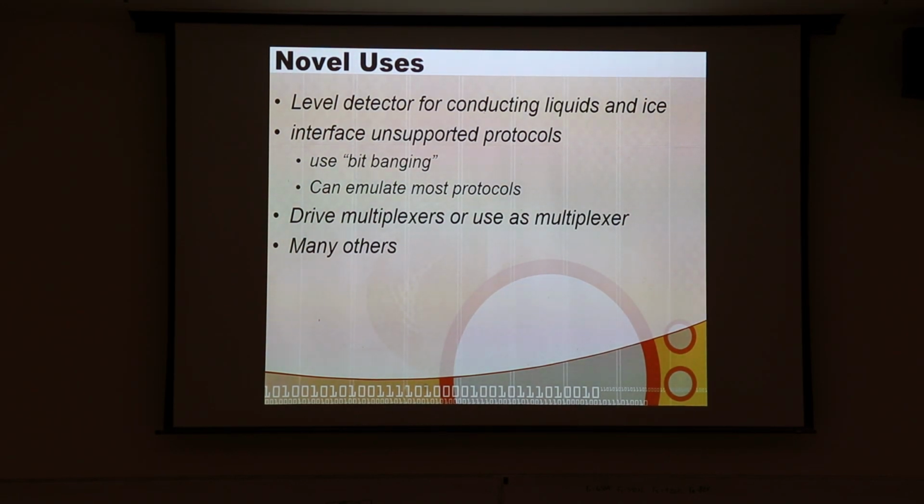That's it. Does that surprise you? Every micro in the car is interfaced to every other micro on a CAN bus, typically, although there are other buses used. And so you at least have to have a micro hot enough to implement CAN bus. That's just for starters, but it then depends on what it's going to do. If all it's going to do is put your windows up and down, or PWM your seat heater or something, then it may not have a whole lot of horsepower.